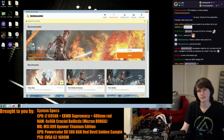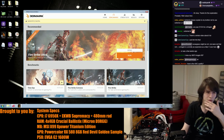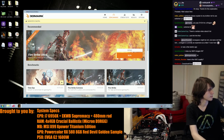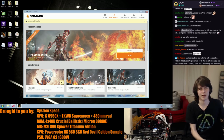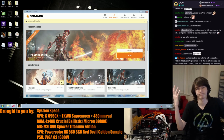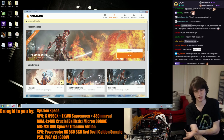You know what I really hate? AMD's latest driver updates broke Trixx. I've not checked any other overclocking utilities, but Trixx is my favorite one, and it's really, really broken. If you try to use Trixx 6.4, well, actually, I don't know if they've put out a new version. They might have. But Sapphire Trixx, any version right now, if you use it with the latest drivers and change anything, it will lock the card at 300 megahertz core clock. AMD drivers, man. To be fair, for most normal users, you can just use the Overdrive utility and you're fine.